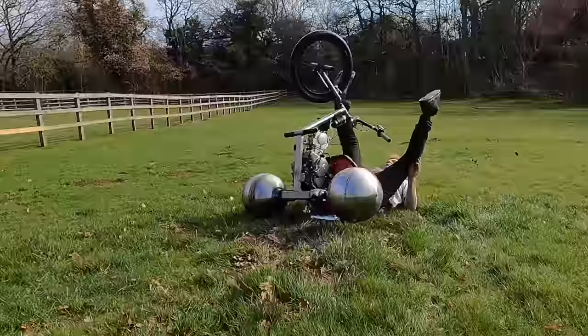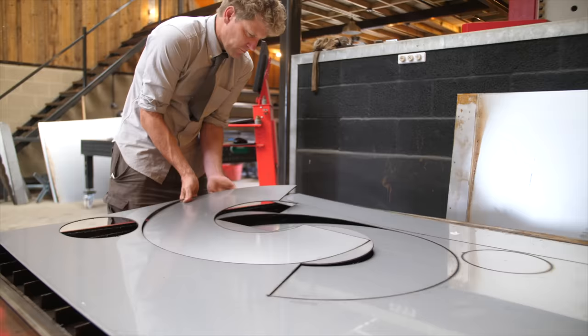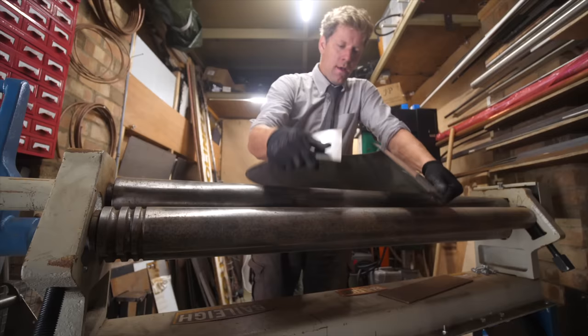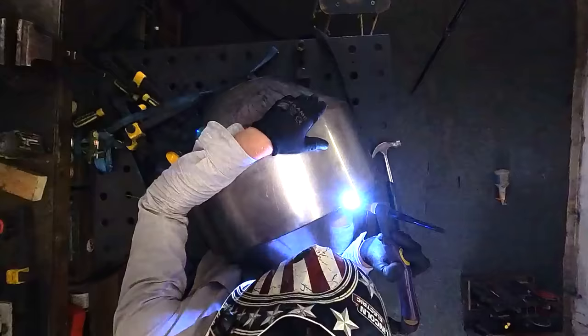I think we need to do a bit of hydroforming. To sum up hydroforming quickly: it's essentially making a 3D metal shape, filling it with water, pressurizing it, and using that pressure to force it into a new shape. It is absolutely perfect for making metal spheres. There are more videos on my channel — I'll link them in the description.